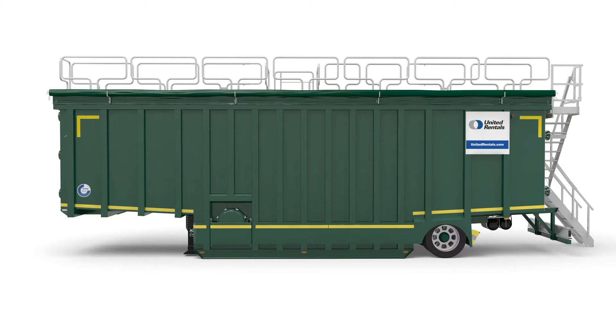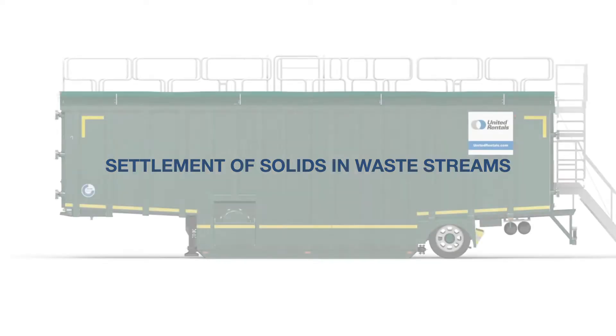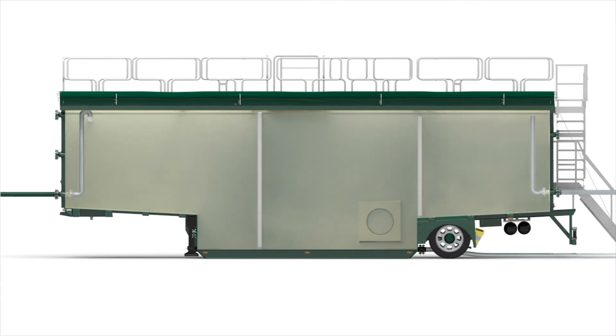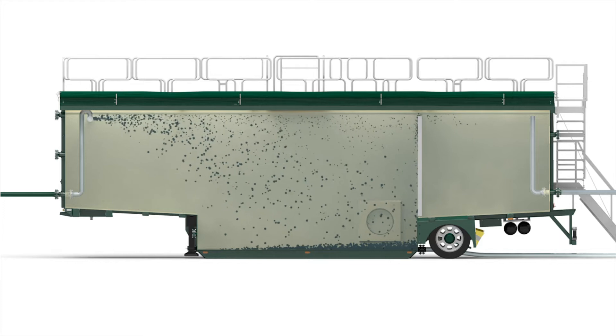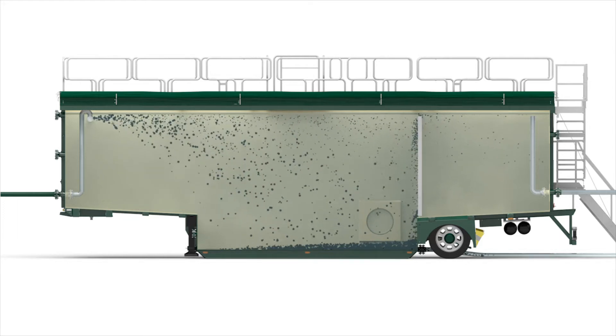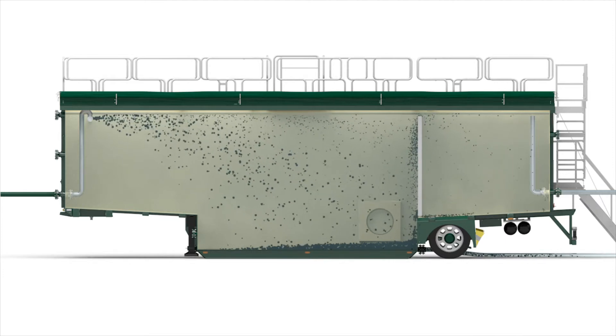As a first example, the filtration open top tank can be used as a bypass for a pre-settlement basin at a wastewater treatment plant. For this application, the tank is equipped with a non-permeable weir in overrun position. As the waste stream enters the tank through a flow breaker, the speed of the flow reduces, letting most of the solids settle in front of the weir. The settled solids can be easily removed by using the drain valves at the bottom of the tank.